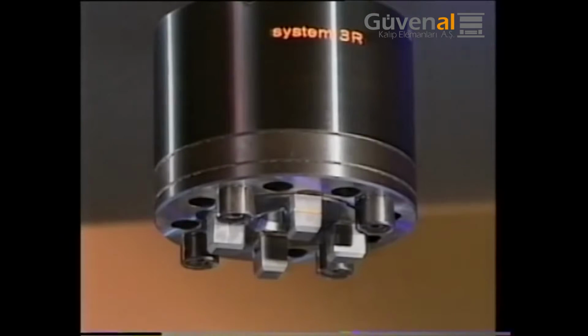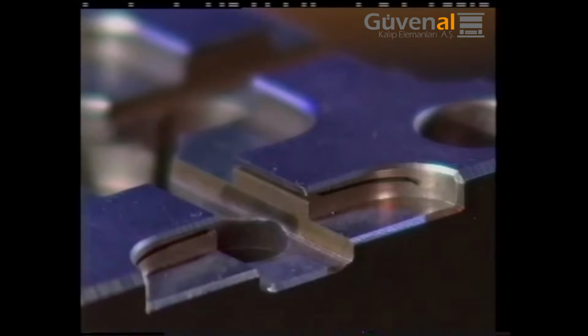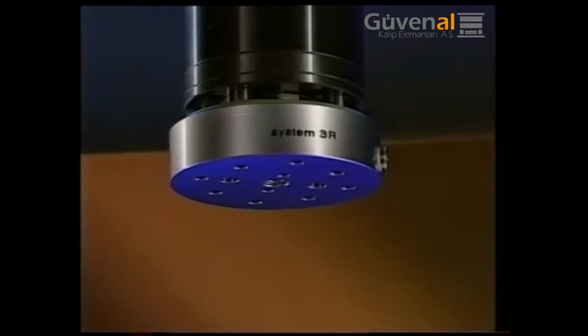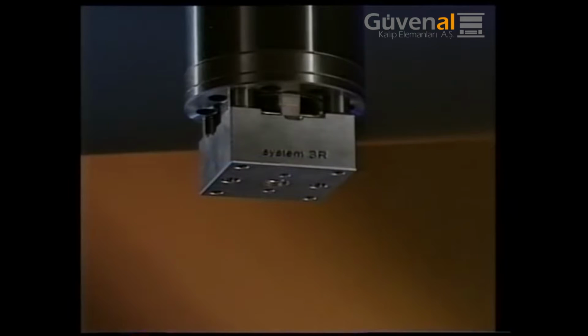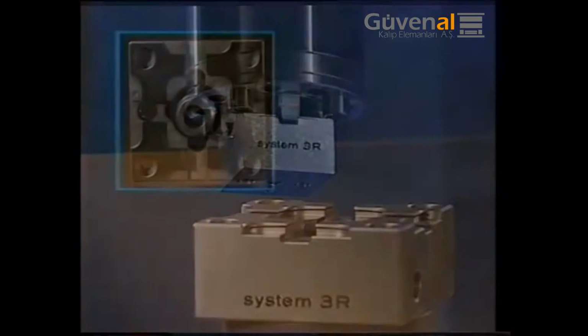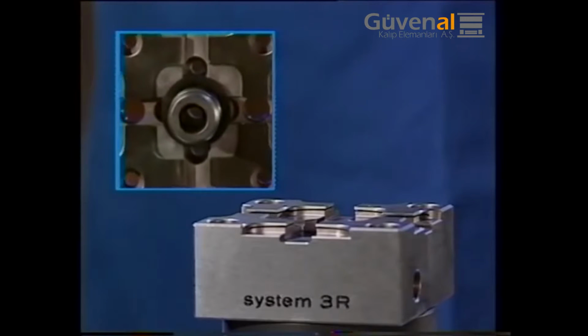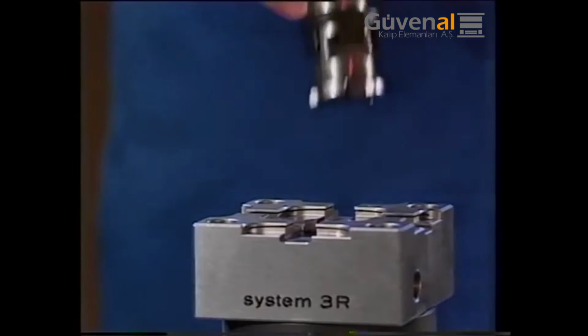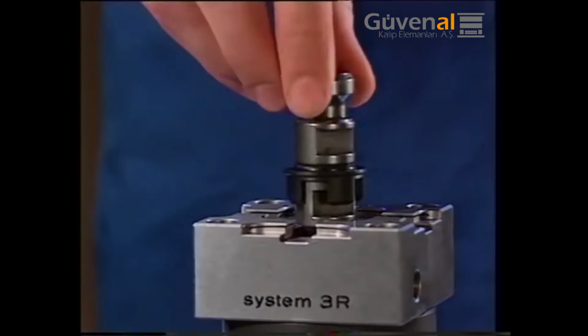Fitting a macro quick clamp holder on the spindle nose will give you a basic attachment that has no market equivalent with regard to robust design, and turbo lock will increase clamping power. Chuck and holder are both provided with permanent and reliable references. There are no loose parts that could be exposed to knocks or jolts that would spoil the accuracy. Another unique feature of this patented design is the floating bayonet drawbar with a large through hole for flushing.